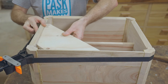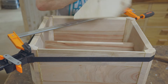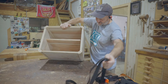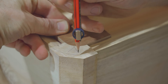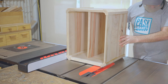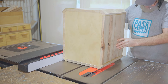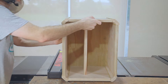I made a plywood square with the corner cut away just so I could check the inside of the cabinet for square, and then put a clamp across to make any adjustments. My band clamps aren't quite strong enough to pull it all together tightly so I added a couple of ratchet straps which did the trick. Next I'll shape the outside radius on the corners — to help mark it out I shaped a small piece of plywood. I've angled the blade to 45 degrees on the table saw and I'll cut each corner at that angle up to the radius line.